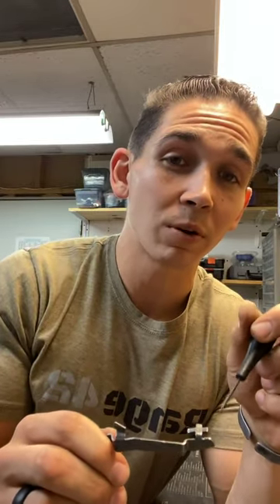And lastly, you have your drop safety. This is the rear of the trigger arm right here in this cruciform, and this rests with both arms on the shelf of the drop safety inside that trigger housing mechanism. So Glocks — very safe.